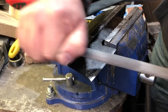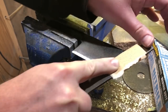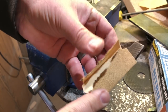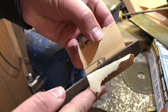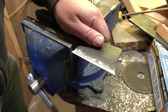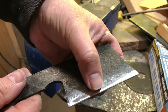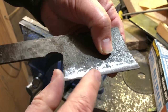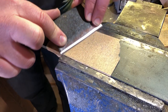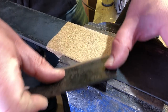When it comes to the last bit of finishing — finishing the bevel and the edge — I like to wrap sandpaper around a file. They do have files with a finer bite, but there's no reason not to use sandpaper at this point. Sandpaper is inexpensive, comes in a wide range of different grits, and can be used in a number of ways to really clean up that bevel and edge. Those files do sometimes leave some pretty deep gouges, so it's nice to come back through with a whole range of grits and work your way up until you have a really nice clean edge.